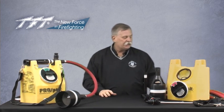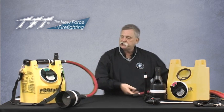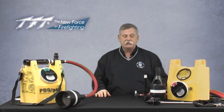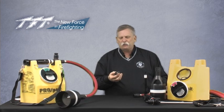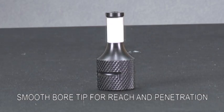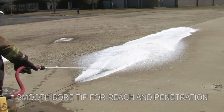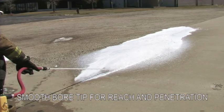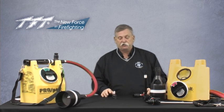Part of the package you'll find typically a short hose, almost up to 3 feet, which is ideally suited for the unit itself, and a choice of three types of nozzles. The smoothbore nozzle is designed for reach and penetration — you'll never make a lot of bubbles or get a lot of aspiration unless you mechanically agitate it. If you're trying to penetrate something deep into the ground, brush, or blown-in insulation, this is the ideal tool.